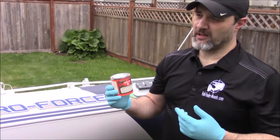So here what you're seeing is actually the bottom part of our glue-on box. And you can actually take the battery out of the glue-on box, or not the glue-on box, but our battery box. And we've got different pre-drilled, not pre-drilled, pre-divots, chamfered divots, that with a quarter-inch drill you can punch these through and mount this, take the screws and put it on our gunnel clamp. In this case it's on the glue-on, so you can take these out and move them around. And if you bought one of these, we wouldn't drill these out at all for you.